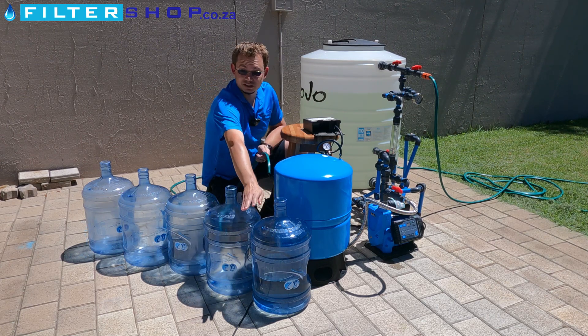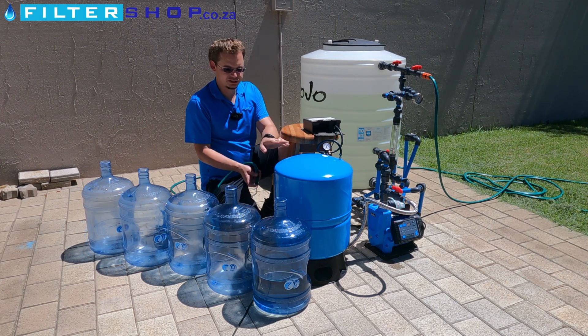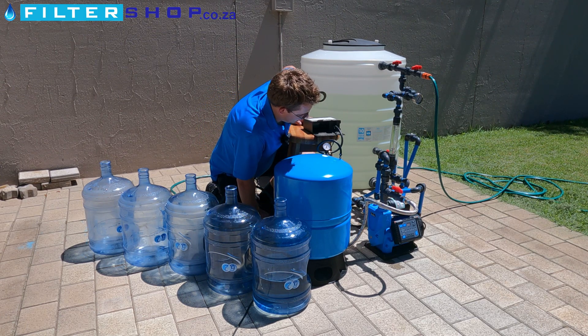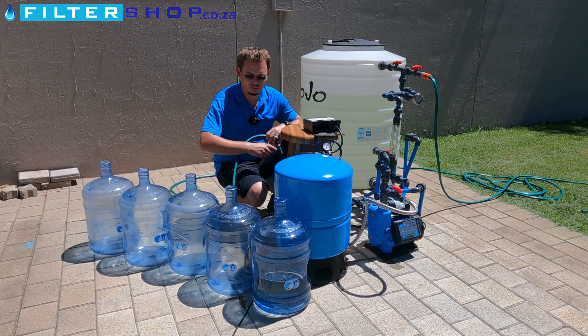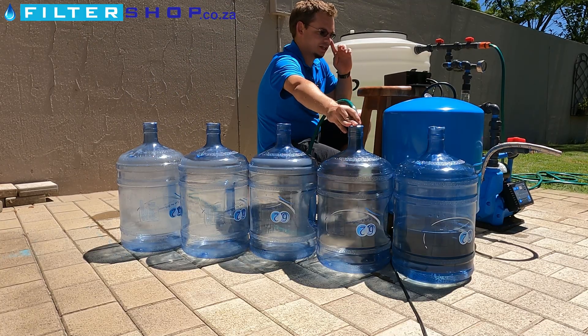So what we've got here is a little bit under half a bottle. We want to test and see what we're actually getting in the tank initially. So we just wait for the pump to get everything back filled up to 3.5 bar, then we're going to switch off the pump and actually measure what the total volume is inside the tank.